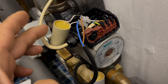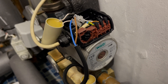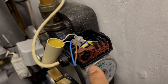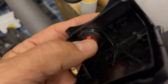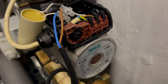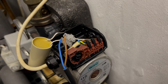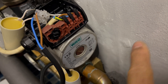The problem with the original capacitor is that it has degraded so much over about 10 years. This gets very hot — the temperature of the log-burning stove goes up to about 80 or 85 degrees centigrade on occasion, and of course heat degrades and ages things even faster. When reassembling, be careful of the speed switch — when you first take the cover off, the contact switch will be in the black plastic piece attached to the red piece. The little terminal inside makes the connection across the terminals, so watch out that it doesn't fall off.